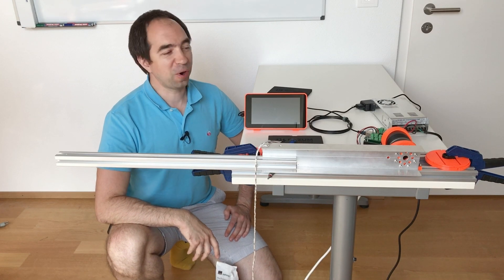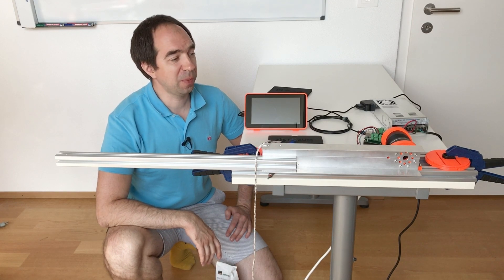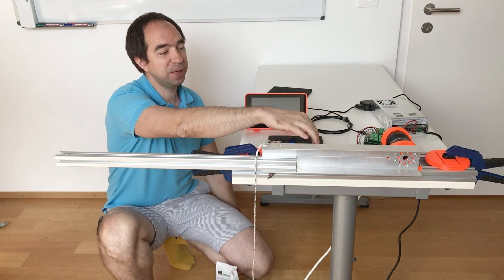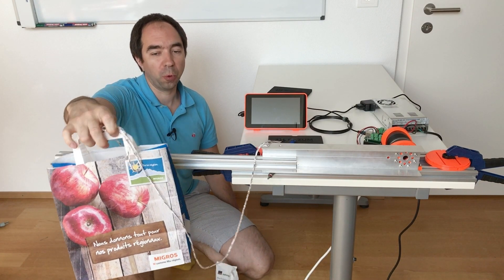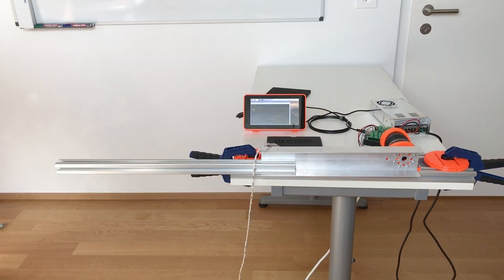In the best tradition of our channel we're going to check the torque of this actuator. I'm not going to push it to the peak torque, but I would like to test some torque. We have this long arm with the base of the actuator fixed. I also have a bag in which we will put some weights, fixed to the end of the arm. Now let's go to the zero position with very low speed and acceleration, just to be safe with the long arm connected.